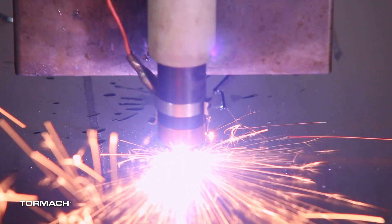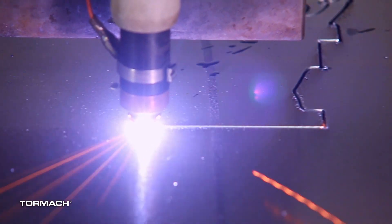And when it does that, there's a cut gap — there's some metal removed — and the width of that cut is called your kerf. Kerf compensation is essentially saying, well, we know that cut is going to have some kind of width to it. Maybe we want to move it over so either the inside piece that we're keeping, if we're cutting around the outside of a piece, or the outside piece that we're keeping, if we're cutting an ID feature, is the correct shape.